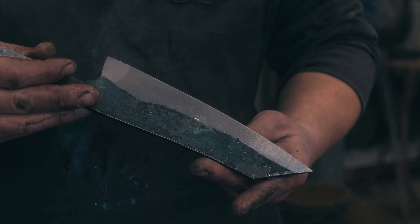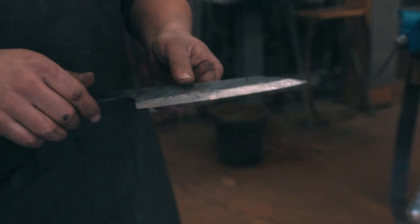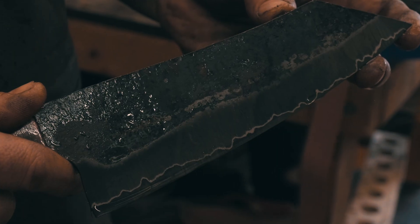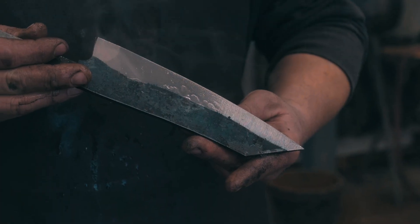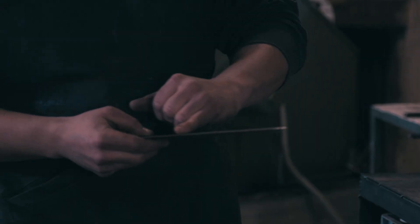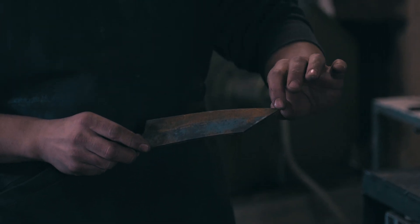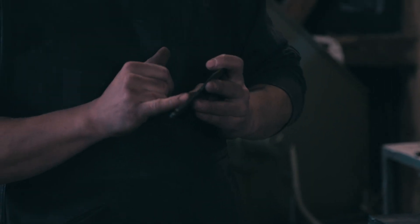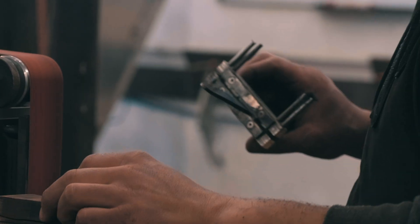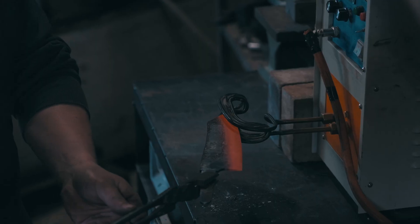We can see the nickel line on both sides. I'll do a quick edge, then you can also see what's going on. So right now we've pre-ground the blade. I did a quick edge on the blade to make sure that my bevels and my cutting edge are aligned, that my bevels are the same height, and that the Apex Ultra core is right in the middle. I've also pre-ground the tang and got the fit-up done.